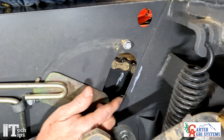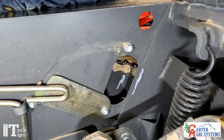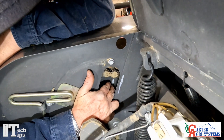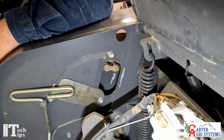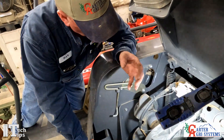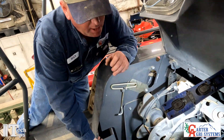If your baler looks like this, then you're in time. If for some reason this sprocket is off, you go down below, loosen up the chain, and jump the chain either forward or backwards to get the timing that you need.